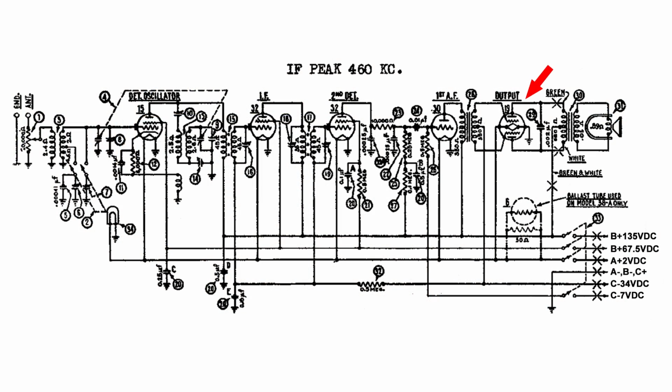Now next to that, what's driving that speaker is one tube, but notice that this tube has two parts to it. So we actually have a push-pull output here, but just using one tube. Basically, we've got two tubes in one here.